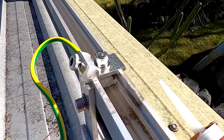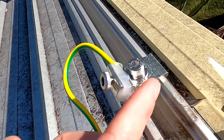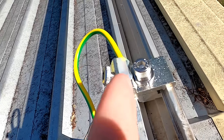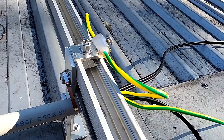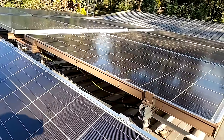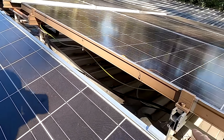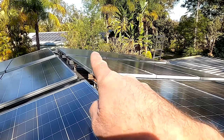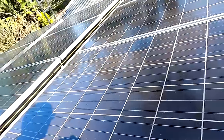As you can see, I went for the silicon option to prevent corrosion from our earth clamps - this is all nice and sealed now, no moisture going in, no corrosion happening. You can relatively easily take it off again and scrape the silicon off if you need to. All the earth clamps are now sealed with silicon. The next big challenge will be to get these earth clamps underneath the rails and under the panels, but there's three strings so there's plenty of space - no big deal.